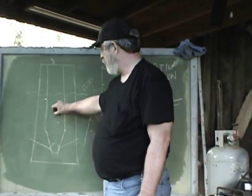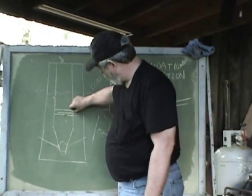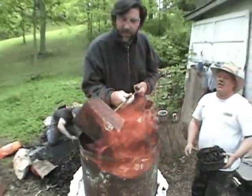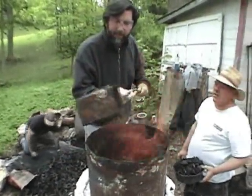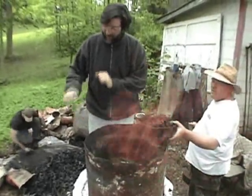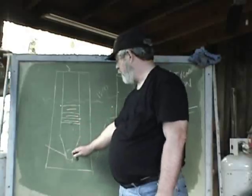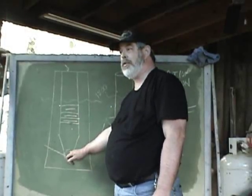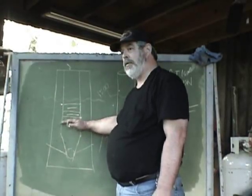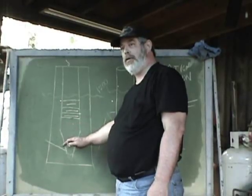The rest of this is going to be charcoal, and then we put a layer of powder on it, then charcoal, and a layer of powder, charcoal and powder, and charcoal. We'll start out with a whole tube full of charcoal and let that burn for an hour, maybe an hour and a half, until all this stuff is nice and hot, everything cooking at temperature. Then we're going to start layering the iron in. As the charcoal down here in the bottom gets consumed — it's almost a zero-ash fire at those temperatures — this stuff will start to simply slide down, the layers of the cake just kept being consumed by this engine down in the bottom.